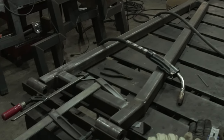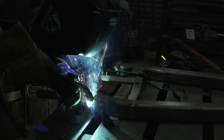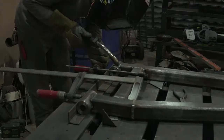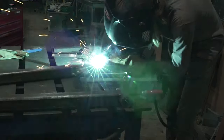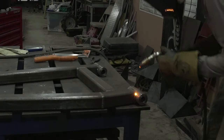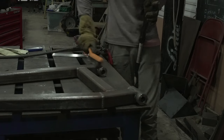Here you can see I got some clamps and an angle iron to hold the pieces of heavy pipe that are the hinges parallel and straight, and we're getting them tacked up. There's going to be a whole lot of multi-passes to get these filled out. I am using 70S-6 filler metal, so it should have a minimum of 70,000 pounds per square inch tensile strength, so with the passes done correctly and good penetration and fusion on everything, it should be extremely strong — which is really important since this will definitely carry a lot of load, and we definitely don't want those to break off.